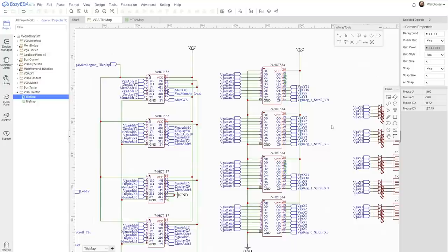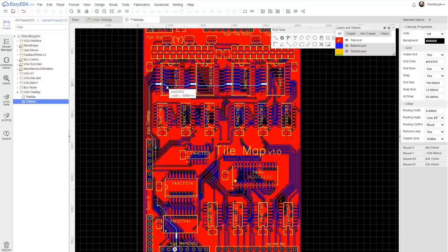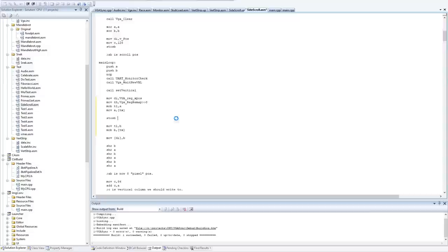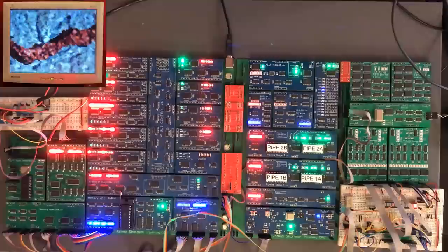Now, obviously I'm going to have to do a new version of this PCB. I can't leave it like this. But is there any way to bodge this? Right, we can cut the tracks collectively here. Then what we need to do is connect the lines up here in reverse order. Okay, well, this is working now.